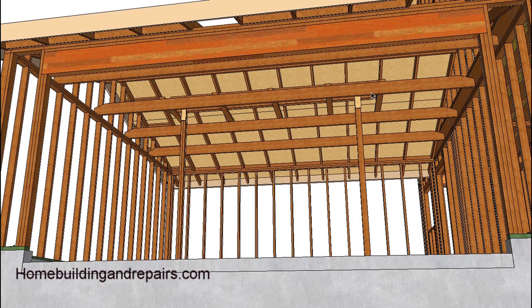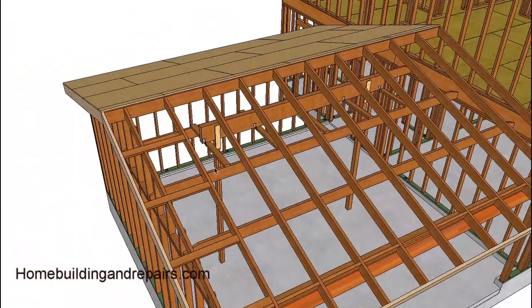If the ceiling joists or garage ties are running in the opposite direction, you can simply put the beam in and put a 2x4 cross or 4x4 - spacing about three feet on center, or just one at each end so the beam isn't moving. We used to lift motors out with these, and a lot of times I was lifting engines that weren't completely assembled - just the block with the oil pan - maybe 200 to 300 pounds tops. My dad had a 4x12 and it carried complete motors every once in a while.